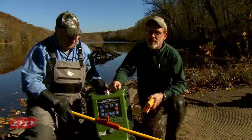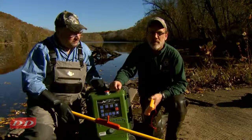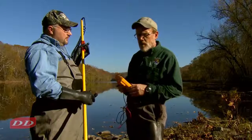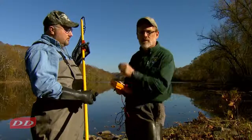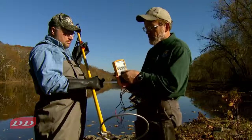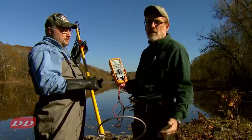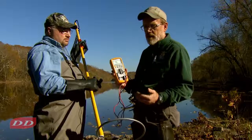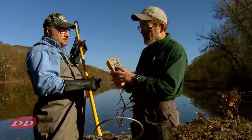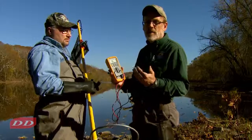Now we know it's not the battery. The battery is good. We need to take the unit apart and check the electrodes individually for wire breakage. The next step is to take the anode pole and check to see if the main conductor is broken somewhere along its length. Simply take a multimeter, turn it to ohms, and look for electrical continuity - a reading of one ohm or less. Many multimeters have a sound function so it will beep if there's continuity, if there's less than one ohm.